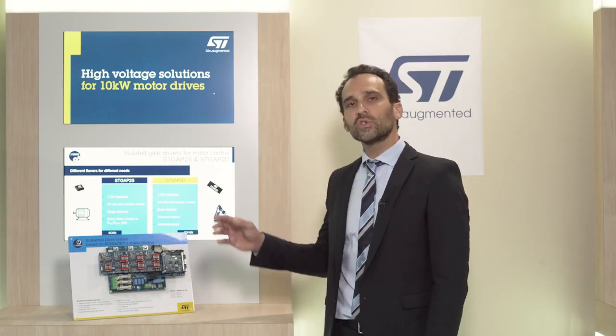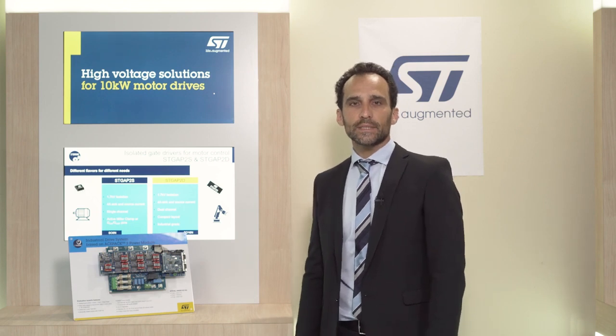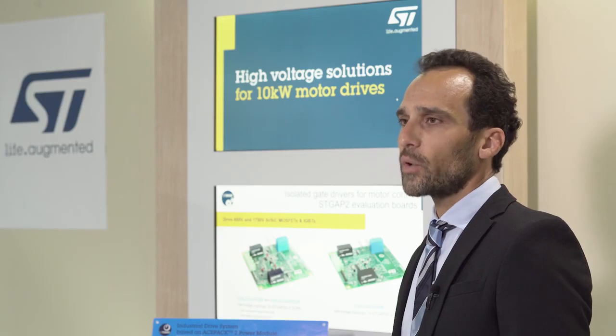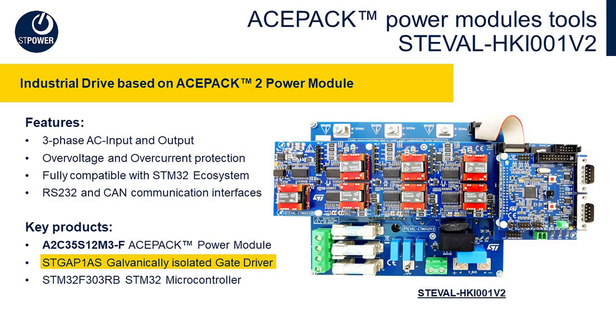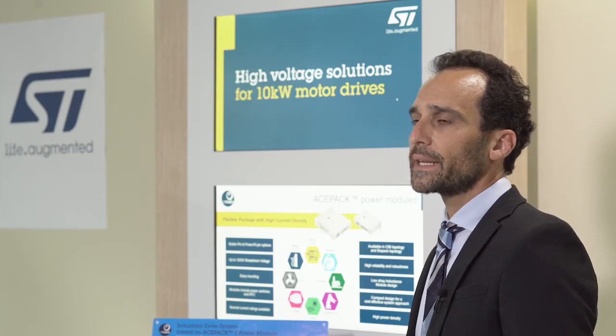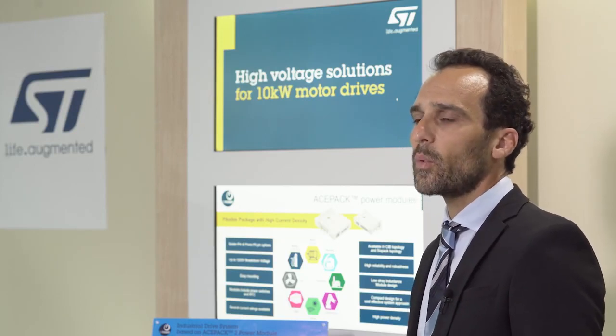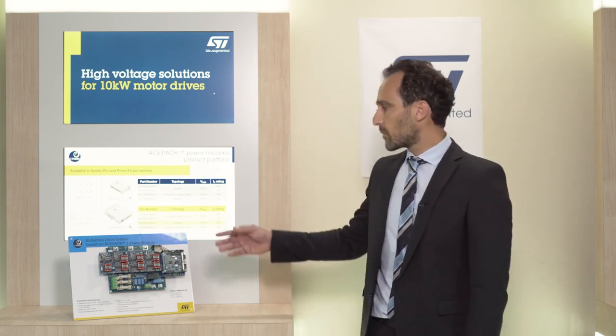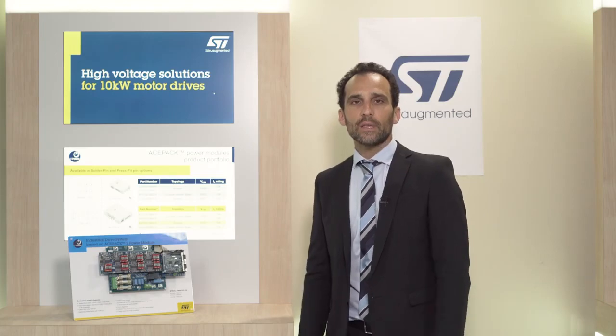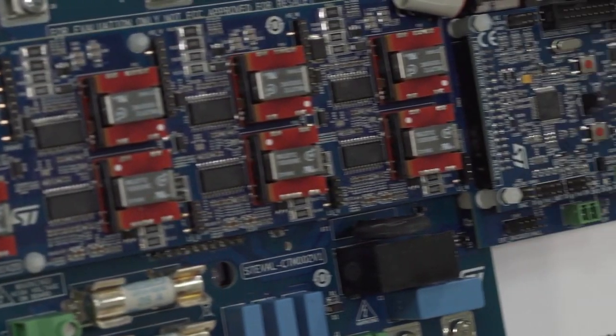In the same board, we have also included a galvanically isolated current sensing circuitry to provide a fully isolated platform. Here is the driver stage, designed around our galvanically isolated gate driver STGAP1AS, with advanced protection, configuration and diagnostic features. An optimized circuitry with high current capability addresses the STGAP1AS to very high power inverters to better drive any IGBT embedded in the power module. Moreover, a full set of protections — like over-voltage, over-current, over-temperature, and an in-rush current limiter — guarantees a high level of fault event management.